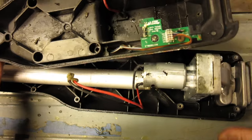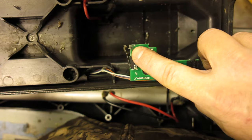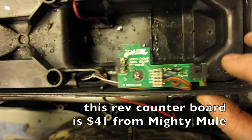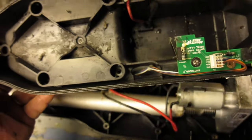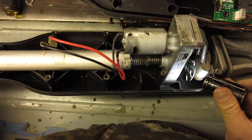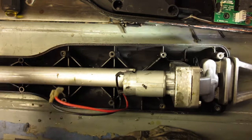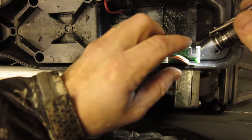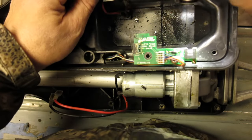You can see there's quite a bit of water in this housing. I don't know if that's from condensation or if it's dripping inside. The first thing I notice is this microswitch is tweaked — the little arm on it is bent and there's some grease on it. Usually the problem in the past has been this photosensor. That's a little IR emitter and detector, and it shoots a beam through these little gaps on this disk and acts as an encoder, telling the controller how many pulses it sees, which defines how much the arm has retracted or extended.